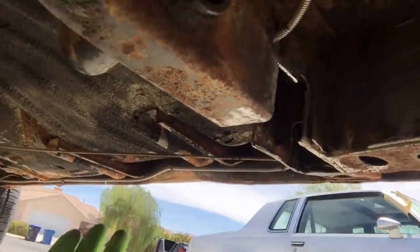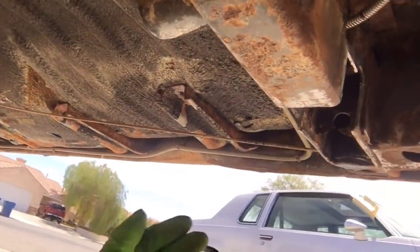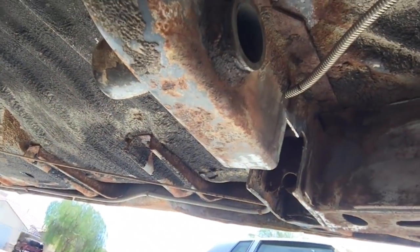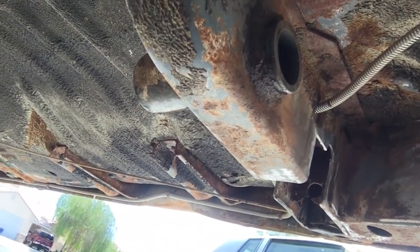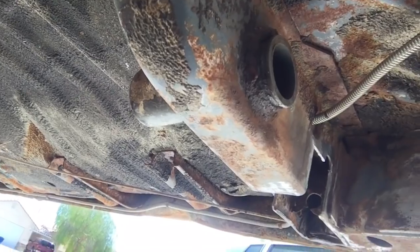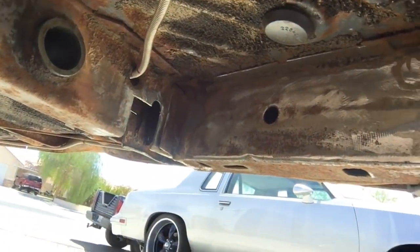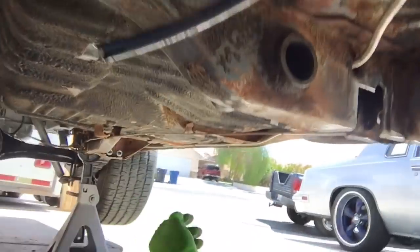So yeah, I mean, those US Car Tool ones are nice and they do work, but those US Car Tool ones look original and they look like they belong on the car because they're contoured to the floor pan. And I've installed several of them. And I like them, but for something that's going to have a lot of power or make a lot of torque or going to tow something or have some abuse on the body, you really need to put real subframe connectors on it, or just put a freaking cage in it and be done. So yep, going to be doing that.